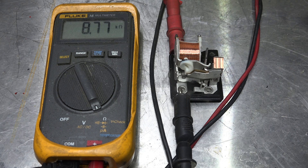This whole thing has been about relays, relay coils, and what it takes to make a coil energize but not burn up. If I took a 24 volt AC relay and hooked 120 volts to it, it would close but it would burn up — way too much power going through it, it would burn the wires up. So these things all have different types of wire on the coils, matched up so they will work with whatever voltage and whether it's DC or AC. I hope this makes some sense — that's it on this one.